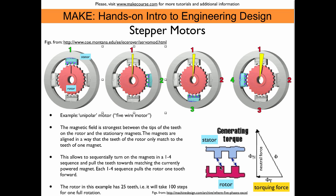The trick to turn this alignment into a stepwise rotation of the rotor is by aligning the magnets on the stator in a way that each of them is a quarter tooth distance — a quarter pitch — off relative to each other. This misalignment allows pulling the rotor a quarter tooth distance forward when we apply the magnetic field to the next magnet. So one sequence of turning on the magnetic field around the stator pulls the rotor forward by one tooth. If we have 25 teeth on the rotor, it would take 100 steps for one full rotation.